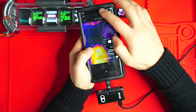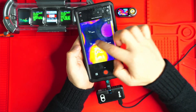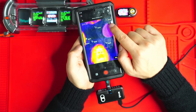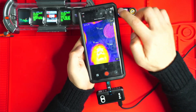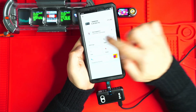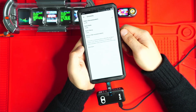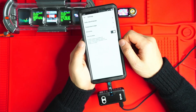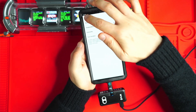You can also set different reading spots on the screen — three spots that you can move around to measure specific areas. The blue dot and red dot identify the highest and lowest temperature points on screen. However, in the emissivity settings, you can only change it to a few presets — unfortunately you can't set anything custom, and you can't go in and change the ambient temperature or distance, which also influences the accuracy of the reading. That kind of bugs me in terms of getting a more accurate reading.